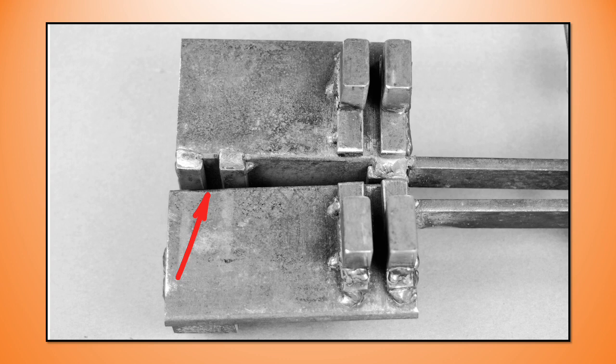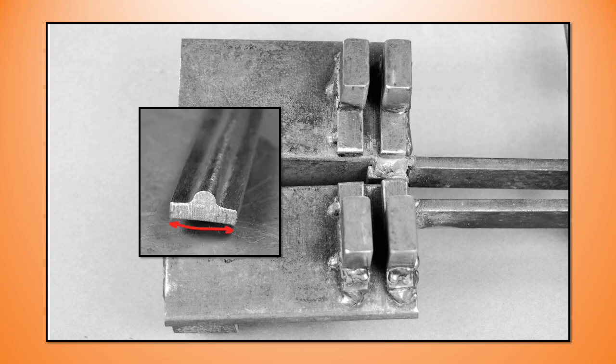Let's have a look at the different elements within this. Firstly, let's have a look at bending the collar material to make a U shape, and I'm going to do that over here. I've got two vertical bars, and they are set just wider than my bead, and wider than the surface of the back strap, so I'm not leaving any ding marks when I'm bending. If I have a look at a piece of collar material, I want those two bars to be wider than this. And equally important, when I look at the bead material here, is the transition to the bead. I want those to have soft edges. So my vertical bars and my jig have got soft edges to protect those transition points.